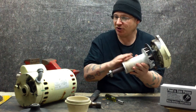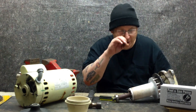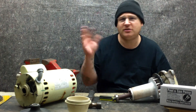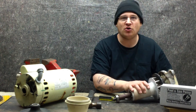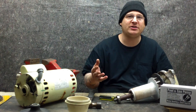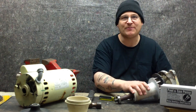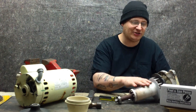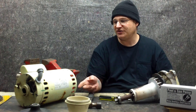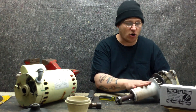Now we're going to get ready to put the armature inside of the motor stator. A lot of guys watch my videos, so just to give you a quick tip here — a lot of people get confused, but don't feel bad, everybody has to learn. On AC motors, which is an alternating current motor, this is an armature and this is actually the stator. Now on a DC motor, like what a lot of guys are used to rebuilding, that's a lot different. There are brushes inside of there instead of motor windings, and your copper would be wrapped around the armature. In the old days, you'd have your copper wrapped around your armature and then a set of brushes. But this is totally different — your copper is actually inside your stator, and this is actually your armature.